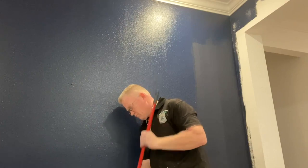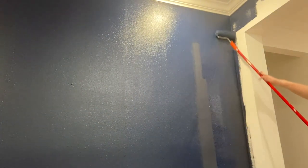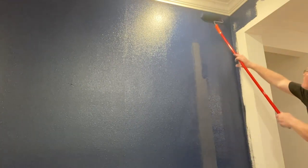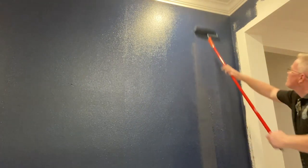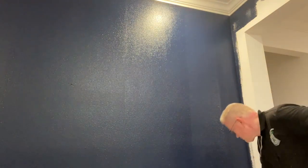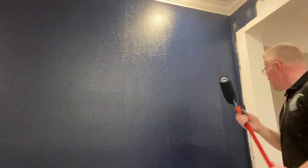And then you can dip in it and bring it to the left. And that's all I'm doing. I'm just using the wall to receive all of that paint. And then I go to the left. See that? See, I dip into it again and I take it to the right. That's all I'm doing. It doesn't change the theory of keeping a wet edge or moving in one direction. See, that's all wet there and it's not drying. You're not going to start drying in 30 seconds. Now I go up to that column and I'm going to overlap it. There I go. I'm overlapping my column. And I think I'm going to put one more on the end of that wall.